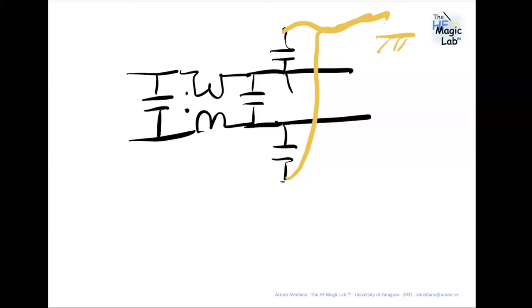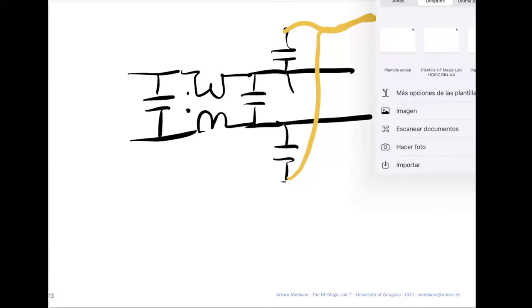Let's see. Is it better to use a ferrite bead instead of an inductor? No, it's different. Remember that, when, I don't know exactly where you refer to use a ferrite bead instead of one inductor. Obviously, in the output of the buck converter, it's impossible because you need to store energy, and you need one inductor, no? And if you are considering some kind of filtering, this is the same idea. Remember, with one inductor, in theory, you have ohms related with omega L. There is no dissipation. Obviously, you have a small resistance that is related with the copper or losses in the core or something like that.